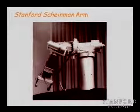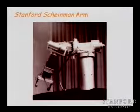So what we're going to do is find the forward kinematics for this arm. This is going to require us to go through the DH parameters first, but then we are going to compute these transformations associated with the DH parameters to find all the transformations for this robot. Then we multiply them out and find x, y, and z at the end effector, and find the orientation of the end effector given the joint angles and the prismatic joint location. All right? We're ready? Yes? All right.